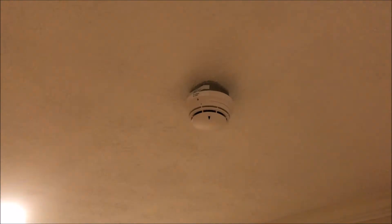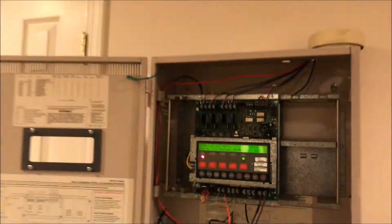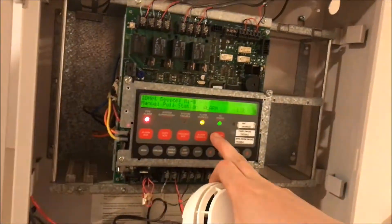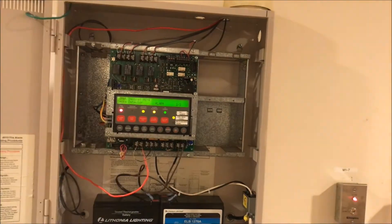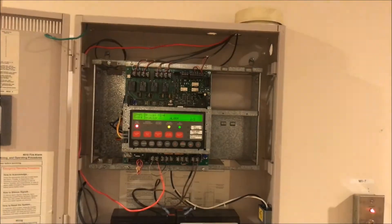While we get the panel alarm we can still test, and we wait and listen to the rhythmic clicking of strobes. Clean out this, put a reset in the panel, and then we get a trouble for the smoke detector. Boom — put the smoke detector back up, panel's resetting. Cool beans.